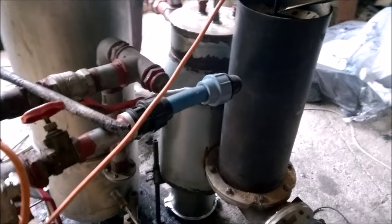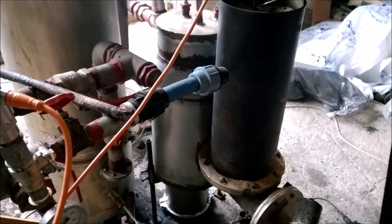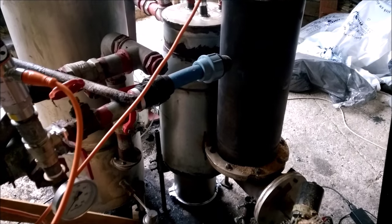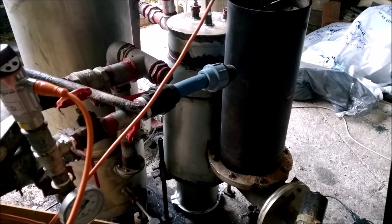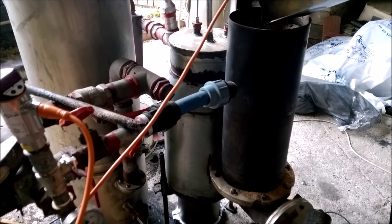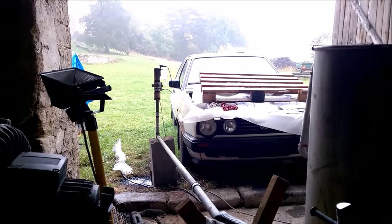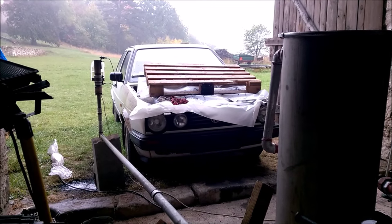The function of the drop box is to slow down the gas stream, so excess dust and small charcoal particles can settle down there before the gas is further transported to the cyclone, and finally the filter, and to the flare and to the engine.